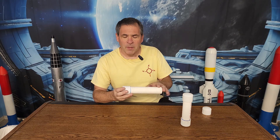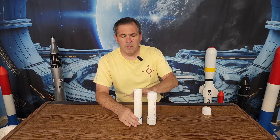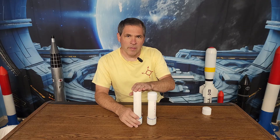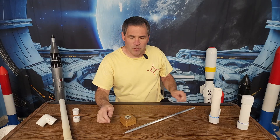I've already started making the new motor. I've got some of the case done and the nozzle is formed in the end. The only difference is that the PVC pipe was cut one inch longer — that's the extra inch where the smoke element is going to be located. So we'll have the same exact amount of fuel in this new motor as in the original Super Monkey motor. We're also going to need to make a small change to the coring process after we pour the fuel.